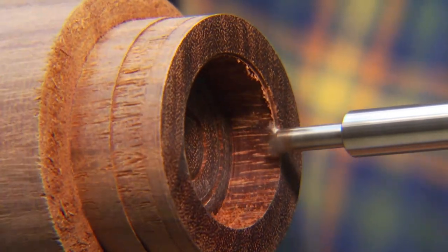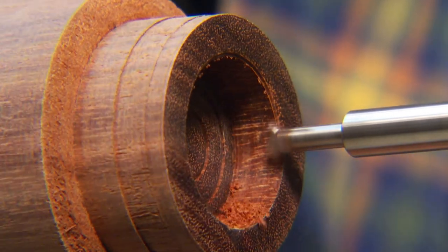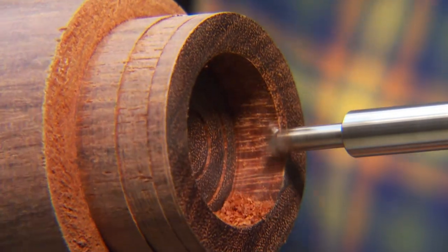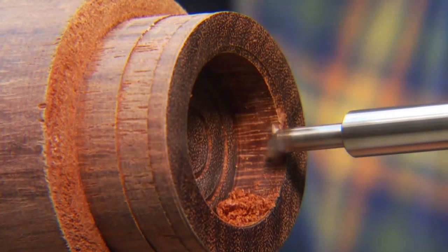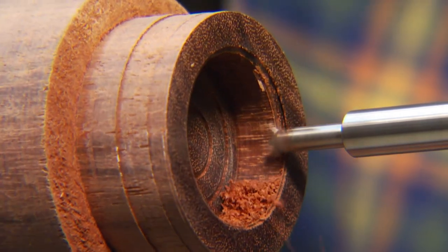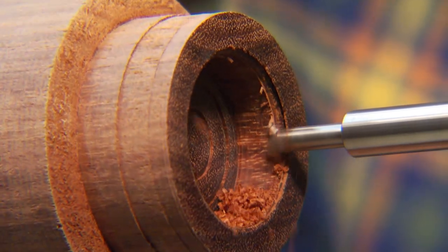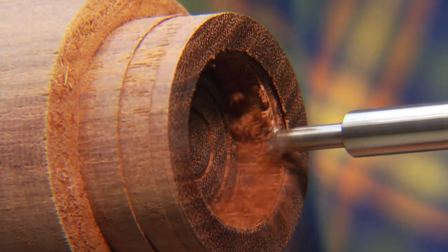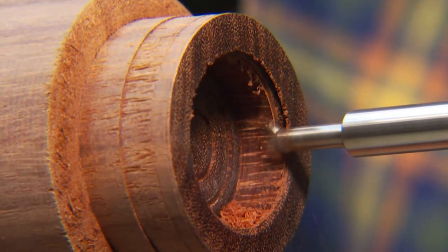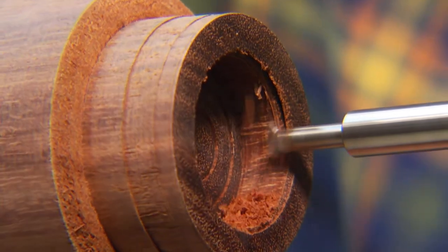And with the female thread, we're actually going to make two cuts. This one's a little bit shallow. The next cut will go a little bit deeper. For some reason, the female threads tend to tear out on the inside. This is so cool. And you can hand chase the threads. There's nothing wrong with that. But I always like new tools and things like that, so it's fun to find something that actually might take some of the excitement out of doing threads by hand.